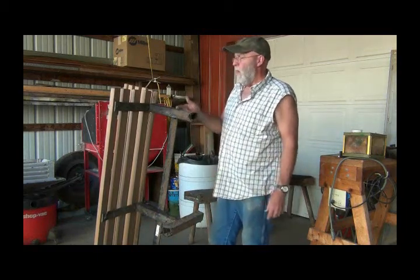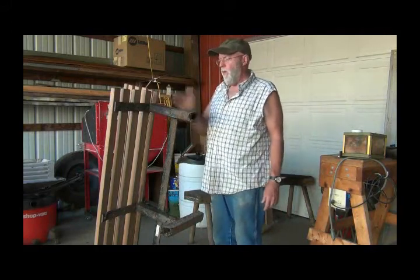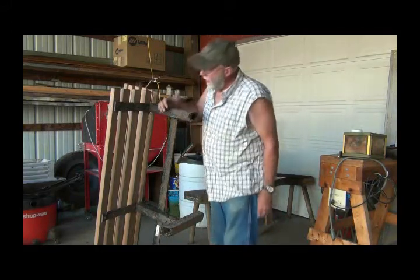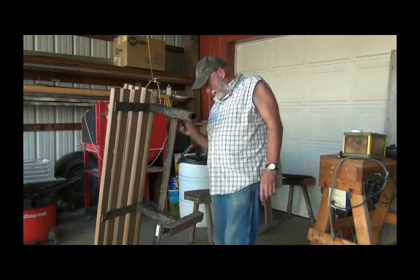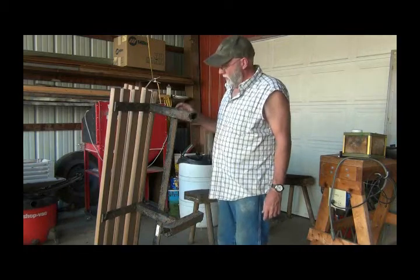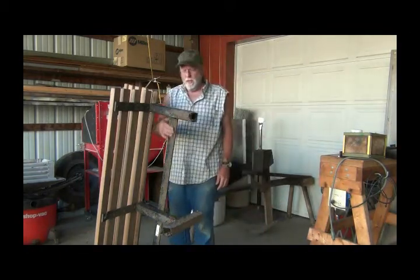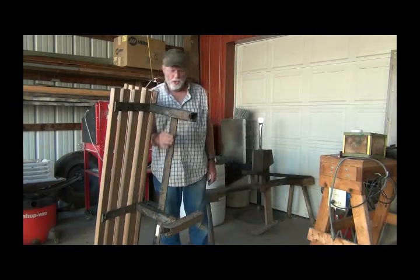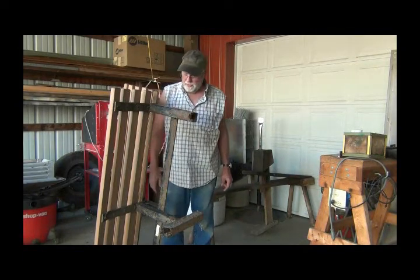He was thinking I could weld a piece on the end. I said the best thing to do is cut it off here and weld a whole new piece on. I'll have to drill a hole through it. Looks like a 5/16 bolt, so that we can bolt this. I don't know if you can see it. There's, looks like about a 1/4 inch by 2 flat that runs along the back to keep some space